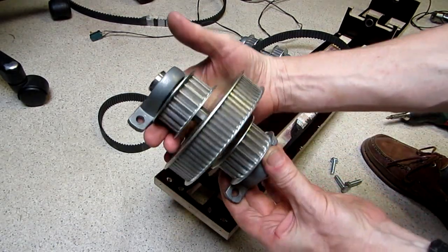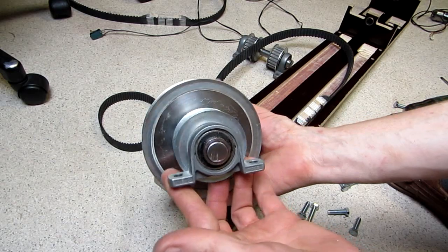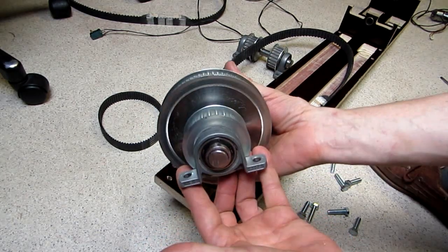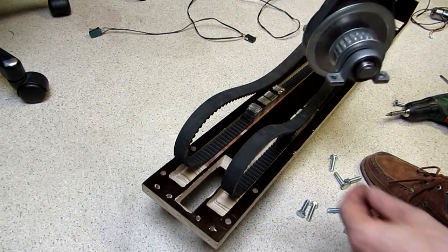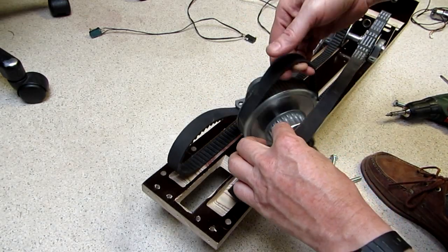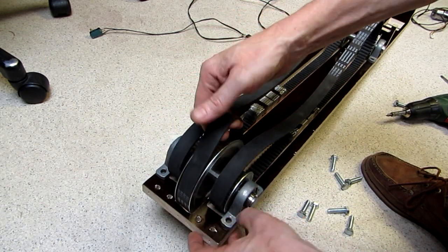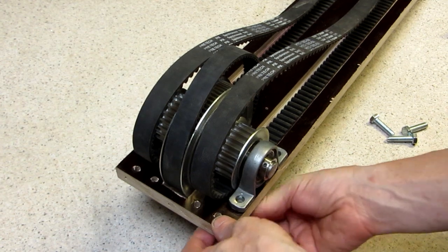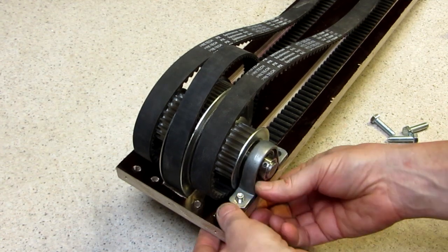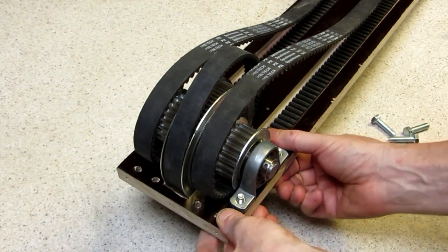This is the main drive pulley assembly consisting of two 22 teeth HTD-8M pulleys and one 72 teeth HTD-5M pulley. They are fixed to the shaft with a 5mm key. Two pillow block bearings hold the 17mm shaft. All belts are 20mm wide. The pulley's teeth are fully lined out.